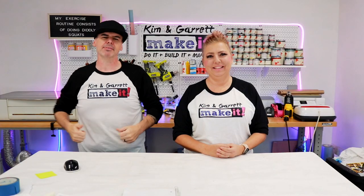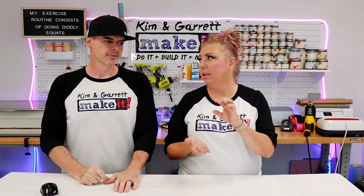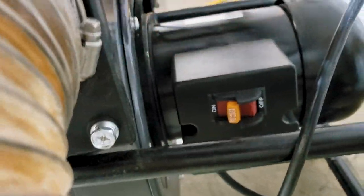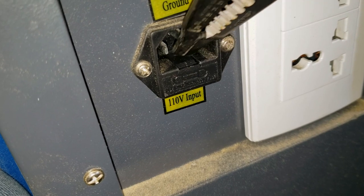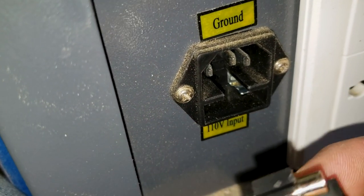Step 6 - time to give it an alignment. Let's see if all of the mirrors and laser tube are aligned for a nice clean beam to the material. This is the tricky part of setting up an industrial laser - making sure the mirrors are aligned can sometimes be a long process because you have to adjust three different mirrors and the focus height. We turned everything on - air compressor, exhaust fan - then powered it up. I think I just blew a fuse. No problem - the fuse is underneath the plug, you just pop it out to check it. It's definitely blown.